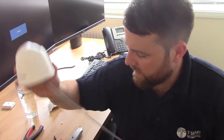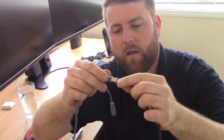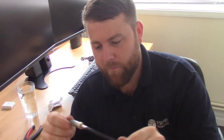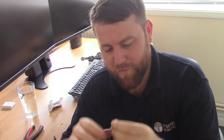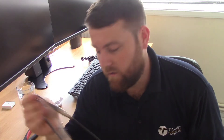Now that's ready to go. So with our camera here — this is just a Hikvision 5 megapixel dome camera — we've got the video input, and then we've got a male and female connector. That just clips into position. On these type of cameras and DVRs we typically use POC cameras, which is power over coax. If you've got two compatible bits of equipment — like the DVR and the camera — you don't actually need the DC cable, so you don't need to run it.